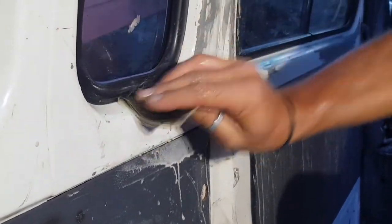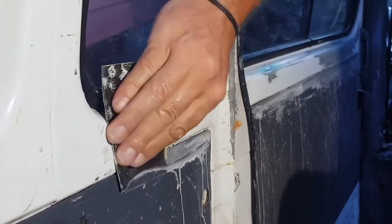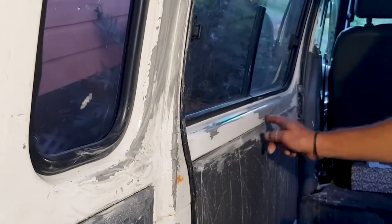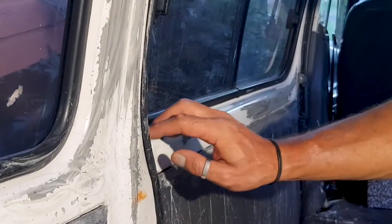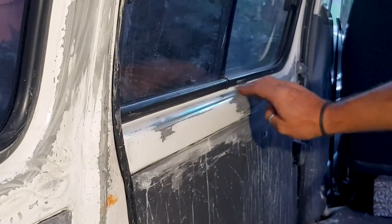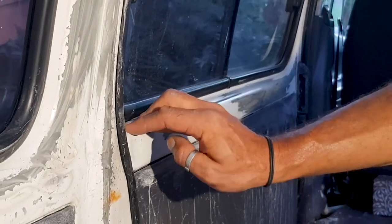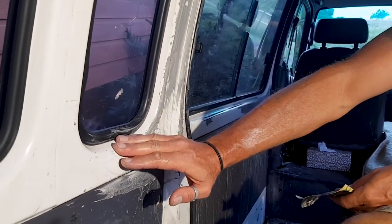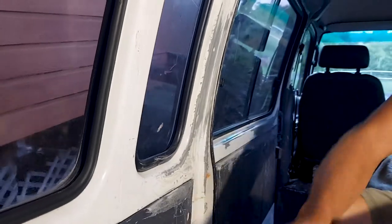And as I said it makes a mess — that's why I'm doing it now and not later. I've already done this bit up here and as you can see, that's all nice and smooth. You don't have to get all the white paint off; all you want is for it to feel really nice and smooth. If it doesn't feel smooth, when you paint it, it won't look smooth. Get wet rubbing.